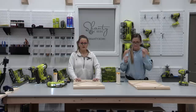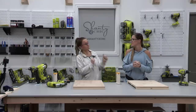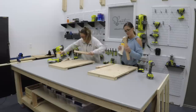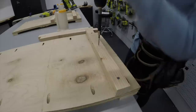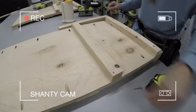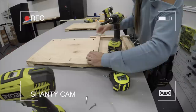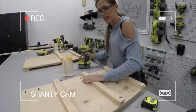We have the outsides of our sides done and now we're going to flip it over and add the drawer slide supports. These are 2x4 boards that we ripped to one inch because that's exactly how much space you need to get the widest drawer possible. We're attaching them in place using wood glue and one and a half inch screws into the plywood sides. There's quite a bit of scrap wood on this piece today — cleats and hidden parts are a great place to use scraps.